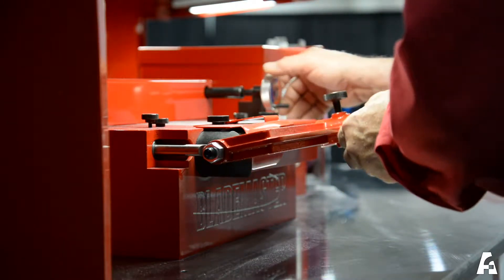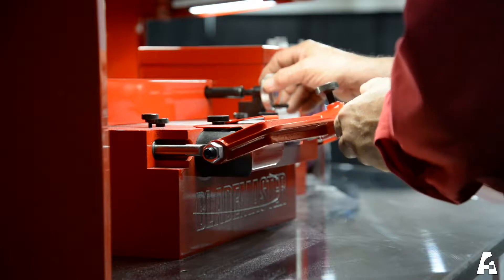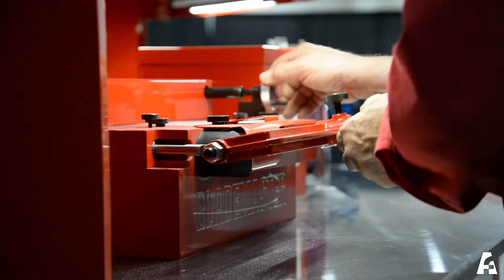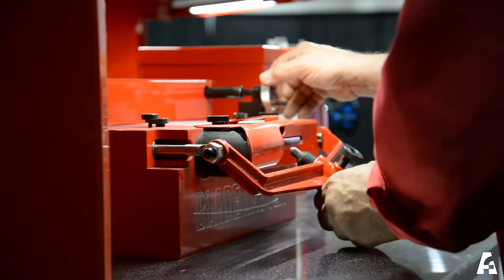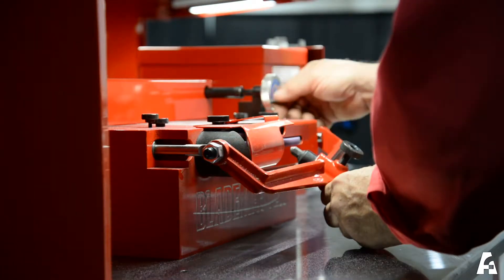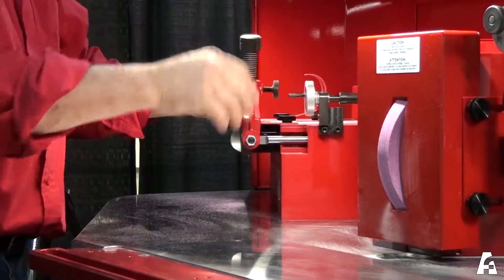Move the diamond arm up and then down. Before raising the arm, turn the diamond ring a quarter turn clockwise. Make sure the diamond has made contact on the entire surface of the finishing wheel. After having used the diamond, move the diamond quill back to avoid damaging the tip and then place the arm back on top.